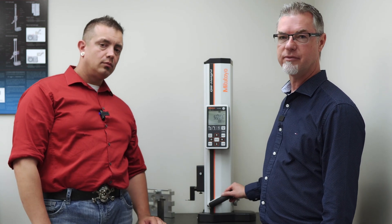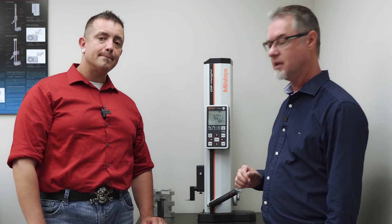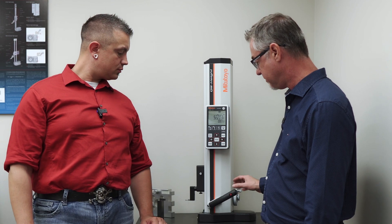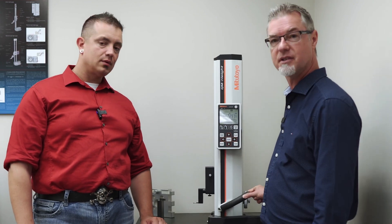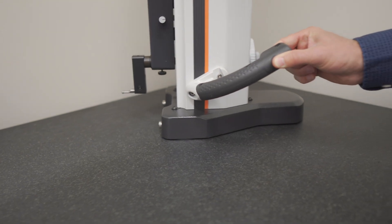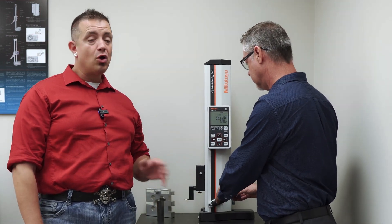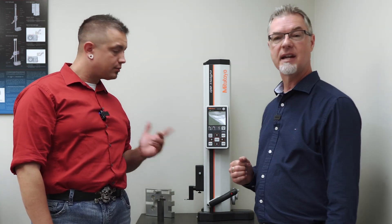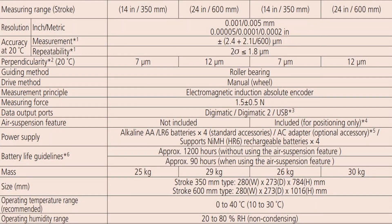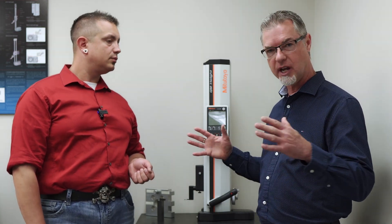It comes in either 14 or 24 inch. The unit you see here is the 14 inch. It also comes with or without the pneumatic float. This one has the pneumatic float, and that's simply a built-in air compressor and some air bearings in the bottom to help move it around. As you can see, it can be moved with two fingers — a nice easy operation. It won't go off the end of the table because all the air will just dump out of one air bearing and it'll stop where it is. The gauge has an accuracy statement that starts at 2.4 microns, or about a tenth. Because it is a linear gauge, the accuracy is not a stated value — it's a formula, so it does change over length, but it does start at about 2.4 microns, so it's a very, very accurate gauge.